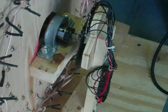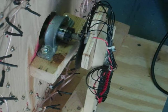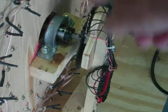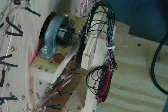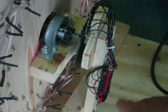And down here, I've got the black CD. I got it painted black with 6 slits in it, so every 60 degrees, and there's 8 LED sensors in that 60 degree area. This allows me to do push-pull, push-pull, push-pull from even and odd coils. That allows for maximum energy going in, and that repeats itself 6 times around the circle. And they're all wired down to these terminal blocks down here.